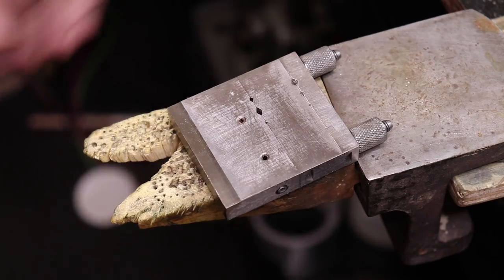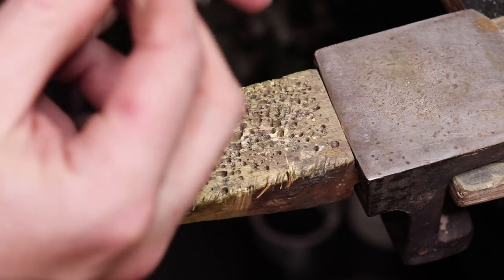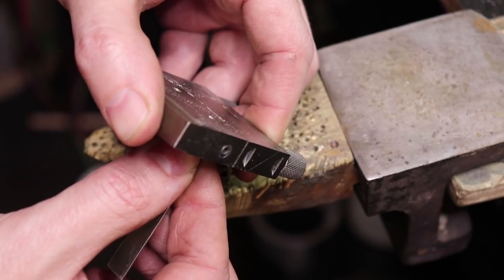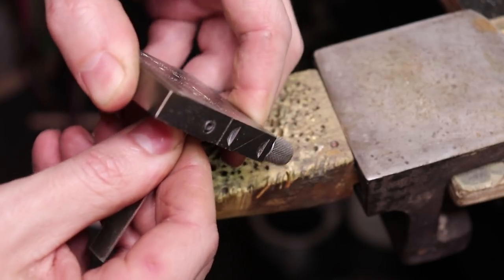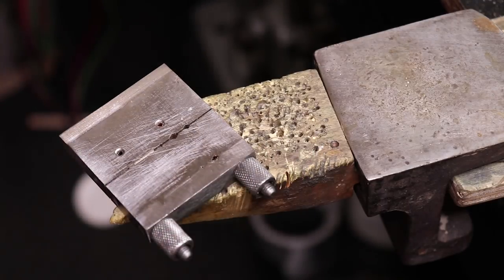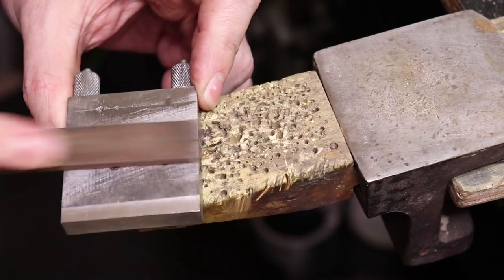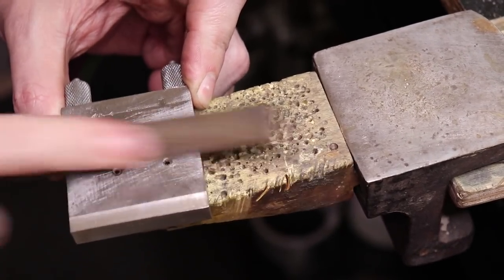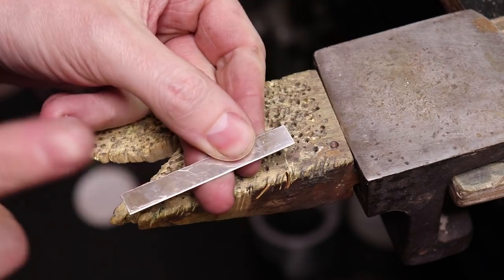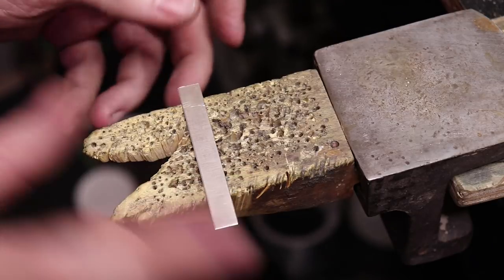You can use one of these to make it so you can cut down your edge to make sure it's as square as possible. When doing this, make sure you don't make it stick out too much — you just want it to barely come out and take a normal file. This particular silver is spring hard or half hard. Either way, it needs to be annealed.